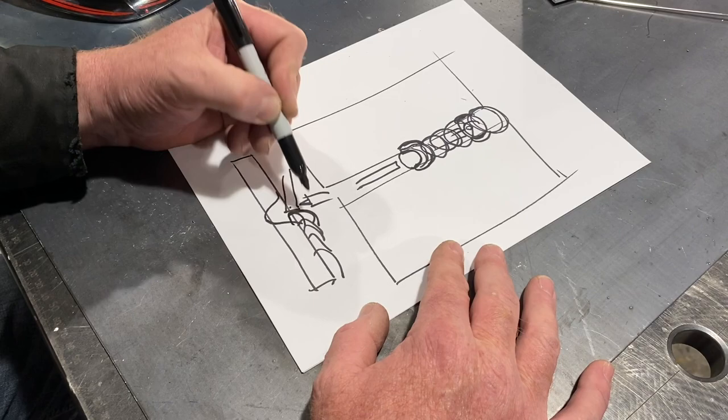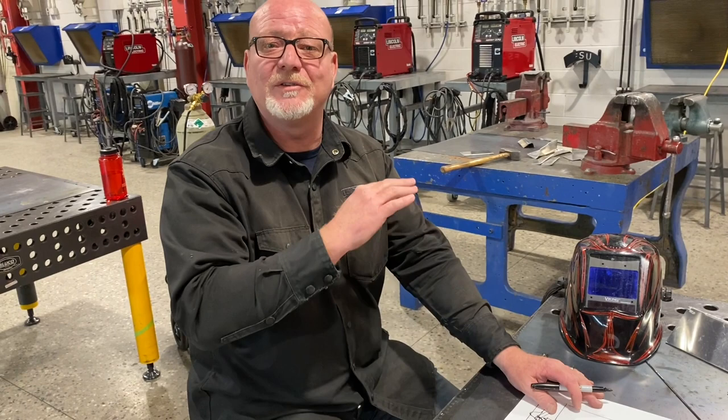It's a really good technique to practice. It's a little tricky at first, but if you practice it, you'll use it for all your welding on butt joints. This is a vertical open root butt joint — focus on right in front of the tungsten and watch those edges moving. Gravity affects it a little bit differently in the vertical position, but this keyhole works the same way. Watch that keyhole open up, dip the filler, and fill it back up. Penetration, and then fill.